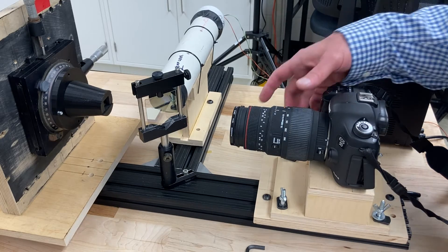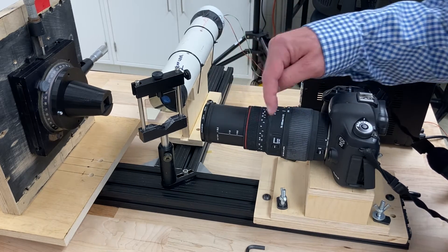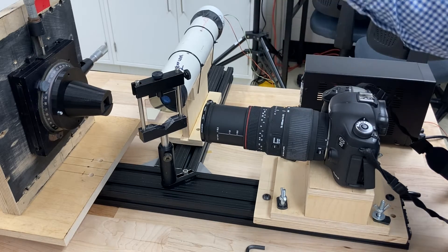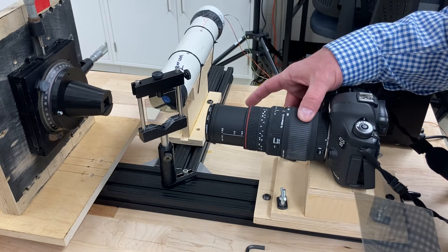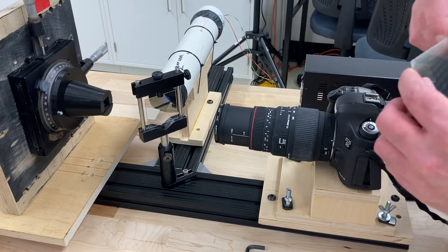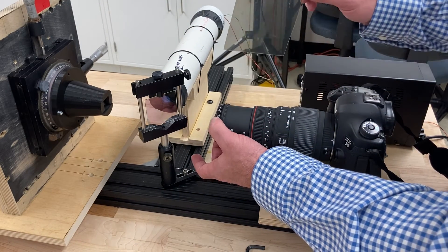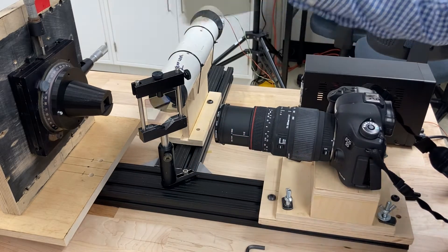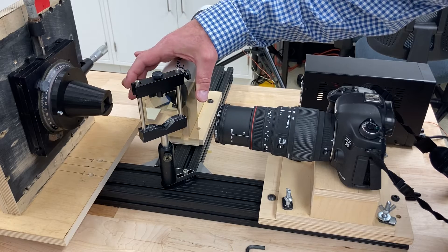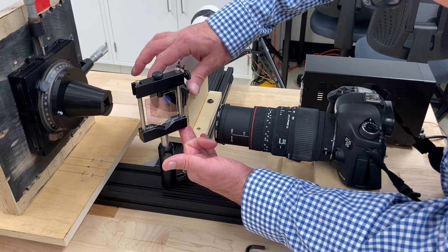At this point, I can explain some of the polarizers. This is a 300 millimeter, in that it matches the numerical aperture of the lens. So when you design these systems, you want whatever lens you're using to match the optics, and the mirrors are very expensive if you go with high, large surfaces or low F numbers. So you figure out what optics you have and match them for the design. The other thing I'm going to put in here is a polarizer, and this polarizer doesn't matter what angle it is because there's also a polarizer here. This is a circular polarizer — it could be a linear polarizer, it just happens this one fits. I'm going to put this polarizer in front of my light source, so it doesn't really matter at the orientation of this polarizer; I'm just going to place it in there, and then we will adjust everybody else so that it works.